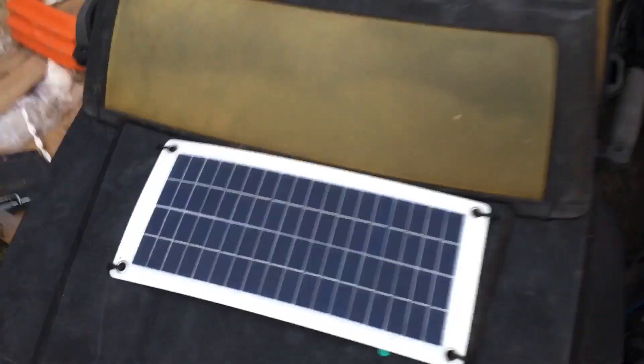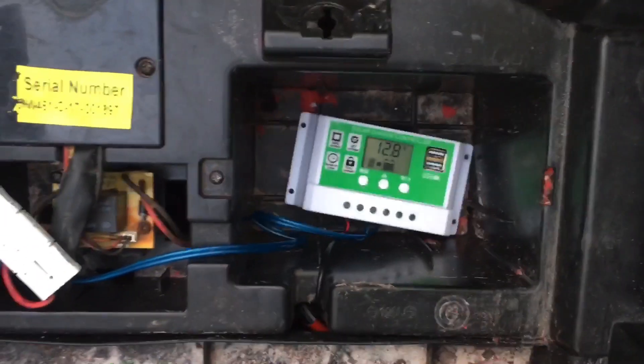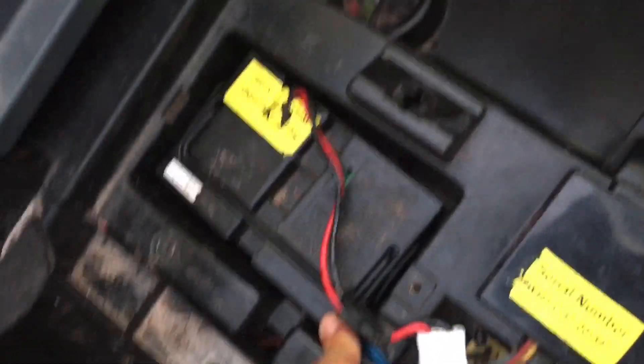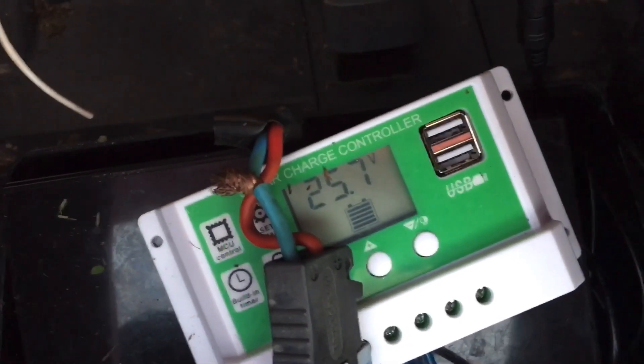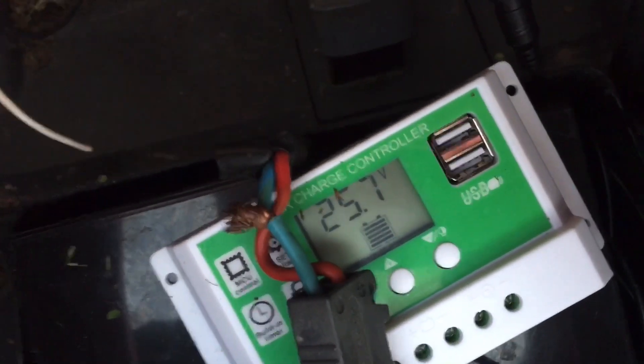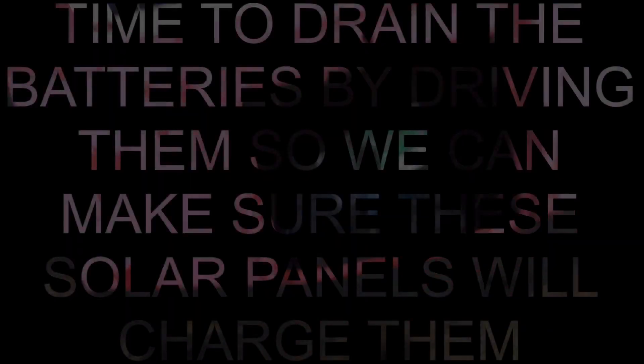They were very excited for the solar panels to come in. This is a 12 volt system — this one is not modified at all. I modified that one there to 24 volt. This one for some reason is charging, but it is only 12 volts, so it probably requires less sun — or it could be because of the angle. I did the same thing: just ran the wire to the solar panel and then speaker wire to the battery. Now when I angle this it's not charging, but I do know this solar panel works. I think the 24 volt just requires a lot more sun before the controller kicks on.